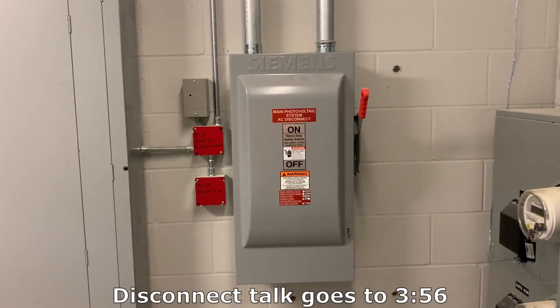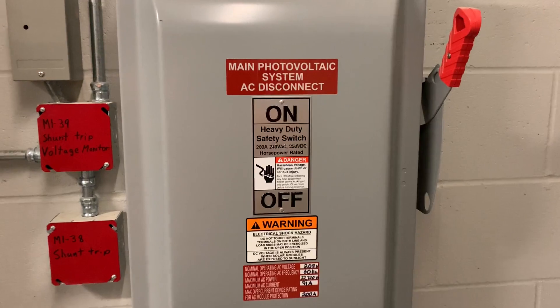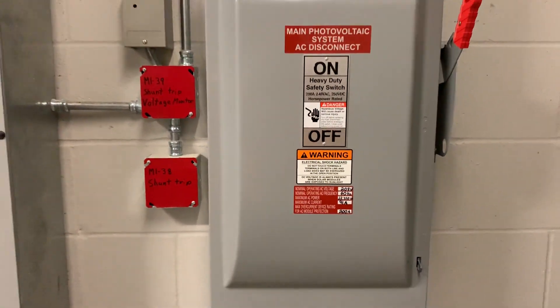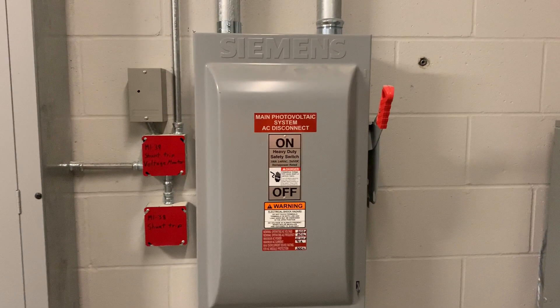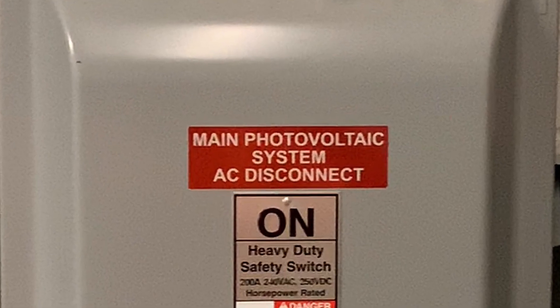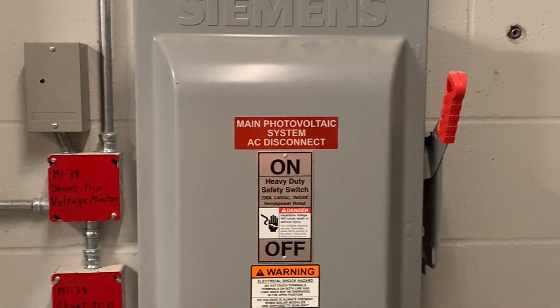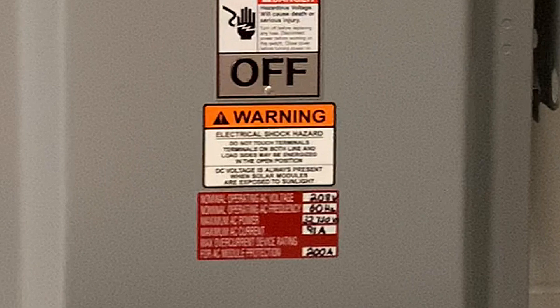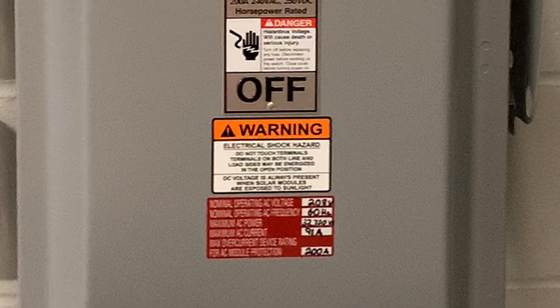So now we'll go back to that main solar disconnect. On this main solar disconnect there are a couple stickers — I'll try to put a link in the description or pictures so you can see these better, or you can pause the video. One of the big ones is the top sticker saying it's the main solar disconnect. That sticker is reflective, and the purpose is so that if the fire department needs to come in to shut off the solar system and it's dark because they've already killed power to the building, their flashlights will highlight that sticker so they know exactly where to go. There are also stickers down low with warnings and specs on what the system is rated at — useful for electrical purposes, like telling someone who comes in to add something what the system is rated for.